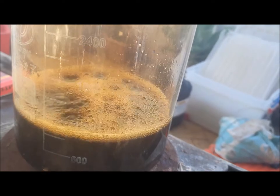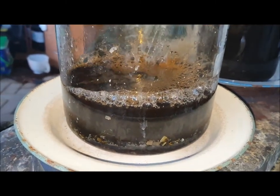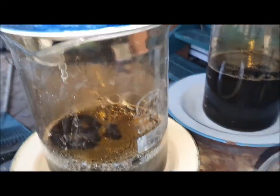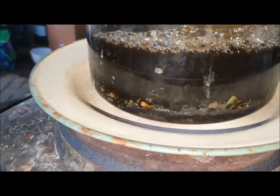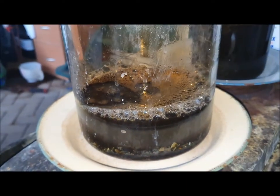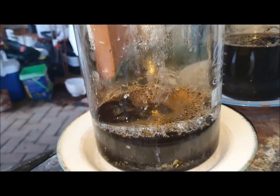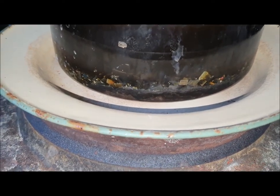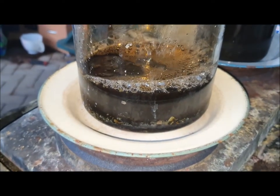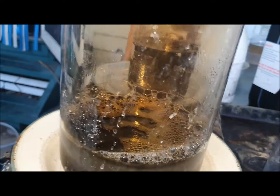This solution has been on for six days and still giving off fumes — I don't know if you can see them but there are very much fumes in there. I can't explain why they're still giving off fumes. What I'm going to do is filter it and I'll probably need to use some sulfamic, because obviously there's still nitric in there for it to be giving fumes off. Then I'll put a fresh batch of aqua regia into the sediment down there and see if I can retrieve whatever else is still dissolving while this is filtering and getting the gold — it's just taking forever. It's ridiculous after six days.